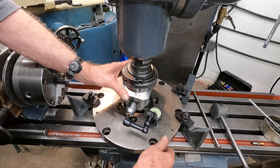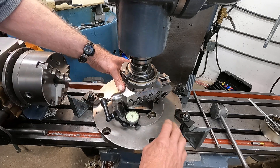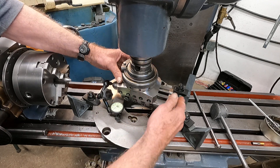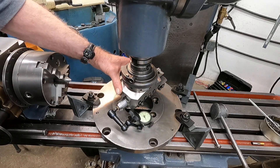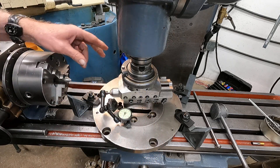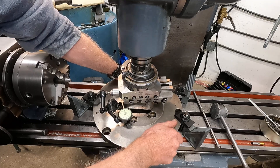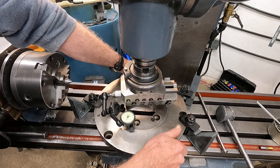I've got the back plate for that lathe chuck in here. I'm going to take a facing cut across it. I trammed the head to the table, and I got the workpiece trammed here too. I was able to get it in tram by slipping an adjustable parallel under this one here. You don't want to get stuff too tight, and sometimes clamps can fool you a little bit — so you want to grab it and see if you can jerk it out of the machine.